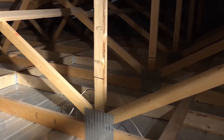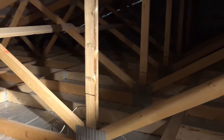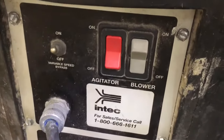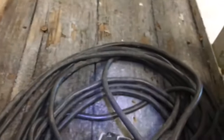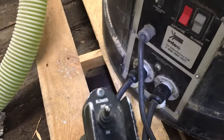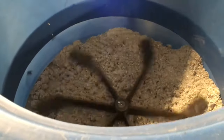That's the prep work — you've got to make sure you mark those lines and you're going to be glad you did. The steps from there are really simple. Here's the machine: it's got a couple switches. Make sure your agitator switch is on and blower is off to start. If you're the only one running it up in the rafters you can control the machine as well, but typically it's good to have a partner. Turn on that agitator — it spins — and then you can dump in a bag.